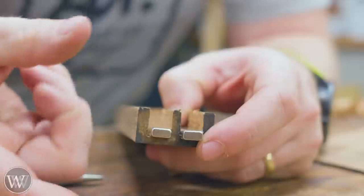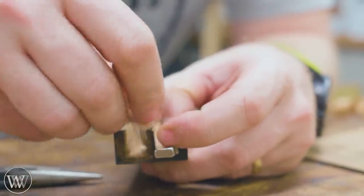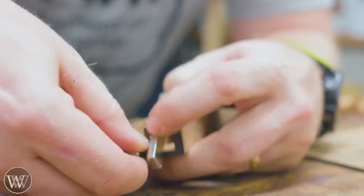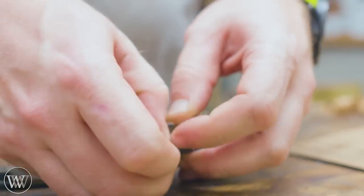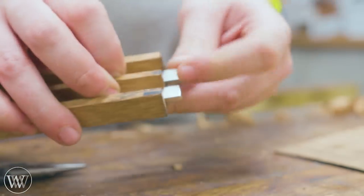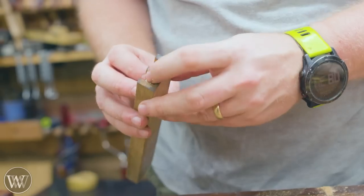I also played with which orientation of the north and south needs to go. Should they push together? Should they push apart? And I found that pulling them together, it gives you a tighter field, which is a stronger field close to it. Having them pushing apart expands the field and makes it much bigger, but it becomes a little bit weaker. So actually having them pull together is what we wanted.